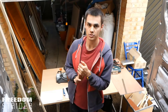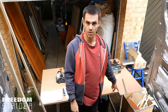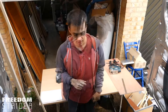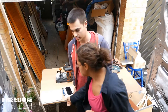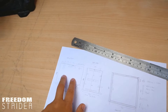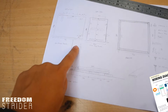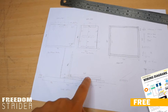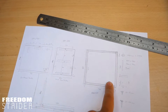So we're going to be building our electrical mount. We've got our wooden base, a small piece for the outer frame, and a piece of ply to mount all the DC electrical boxes on the side. This is a relatively straightforward design — nothing overly fancy. We have two ply walls: one for the charger mount and one for the fuse box mount. Here's a cross-section view of how it's going to look — the walls, the little feet, and a 15x15 bar that will hold the batteries in place.